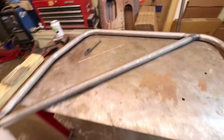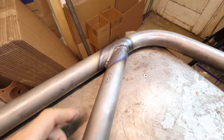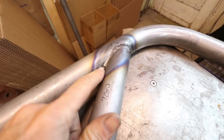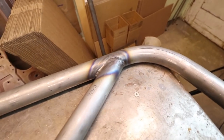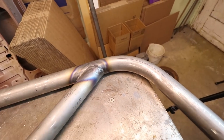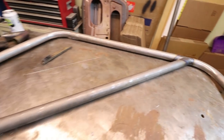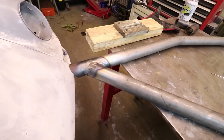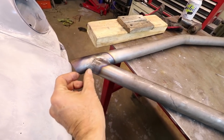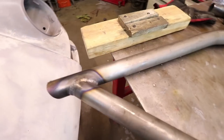I just finished up all the welding on this tube — it's had some time to cool down. You can see here this is the top half. The welds are okay; I'm not going to win any beauty contests with these welds, but it's structurally fine. Like I showed on the sample piece, I cut it and the penetration was all okay. Here is this lower section — this is less than 100 millimeters. Here is the weld coming around.